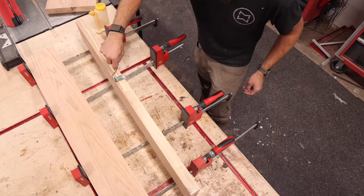As I stated earlier, because of the jig, material sizes, and all of that, the pieces aren't quite cut deep enough — about a quarter inch maybe a little less. So I'm using a jig John uses for cutting dovetails to clear out the pins, with a straight-cut bearing bit to clean out this part. I have it set to the right height — hope this works, gonna try.